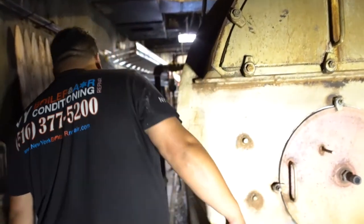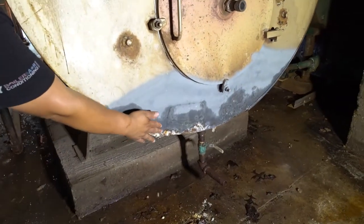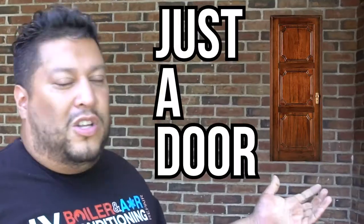Let's open up the back door and look further. This is not looking good — you can see it, look at this coloration, all this calcium, and it stinks. All right guys, we're about to go into the boiler room and open up the door in the rear. We call it a manhole door. We're going to open it up, take a look inside the actual chamber, and see if there's any leaks there. There's definitely a leak — we just got to find it.